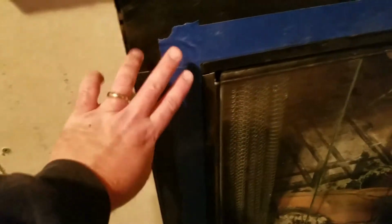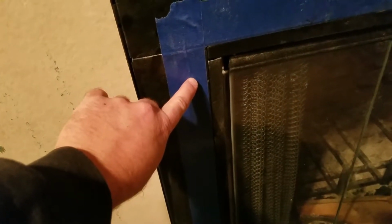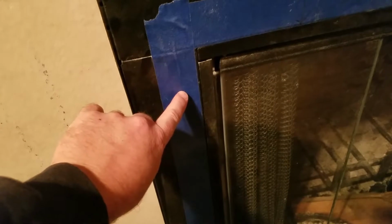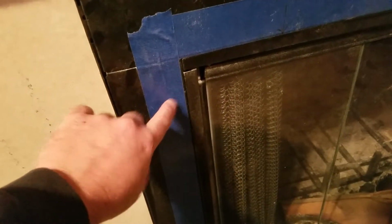So we'll have to use a different medium here than we will here to stick the veneer. We'll be able to do a mortar base right here, and then we'll have to do an adhesive base here where it comes over the trim piece. We'll see where the factory edge is. I think we're going to be a little bit short of that mark with the factory edge, so we'll let that be the call of our client, whether or not they want a smaller piece here. That tends to be problematic if you have a little tiny piece at the end. So we'll deal with that.